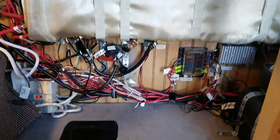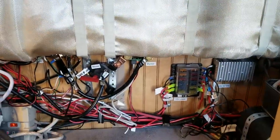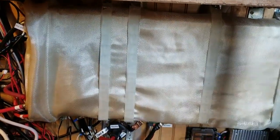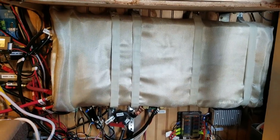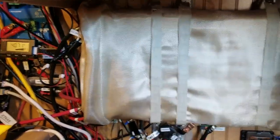I've redesigned this many, many times — when I had the AGM batteries where this storage box is now. I'm hoping I'm done by now. We have a 24 volt Tesla module that has about 444 little Panasonic battery cylinders in there. It's lithium ion — I believe it's cobalt chemistry — so it's potentially a little bit more vulnerable to thermal runaway than lithium iron phosphate. On my website I talk about the pros and cons of this versus the safer battery. So I wrapped this in fiberglass — this is a welding blanket I got for about $20 at Harbor Freight.